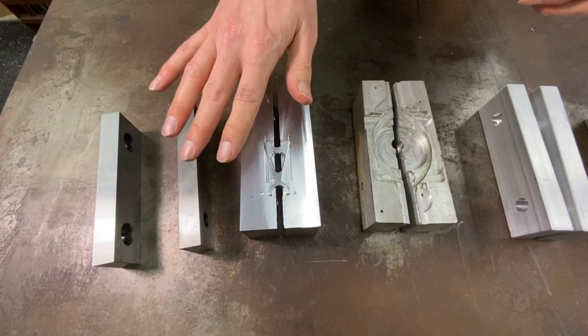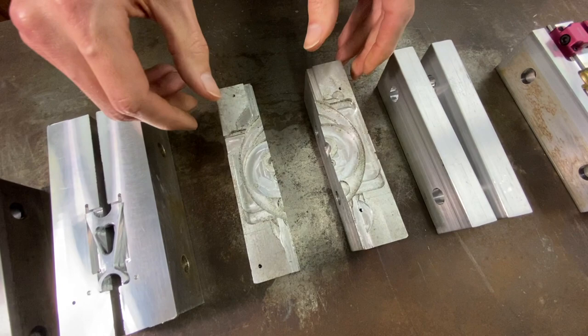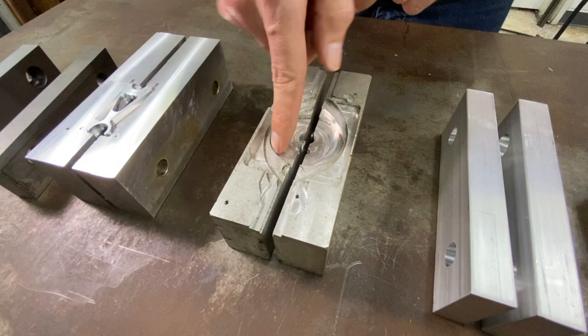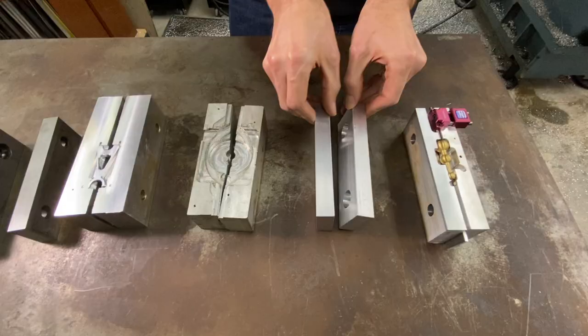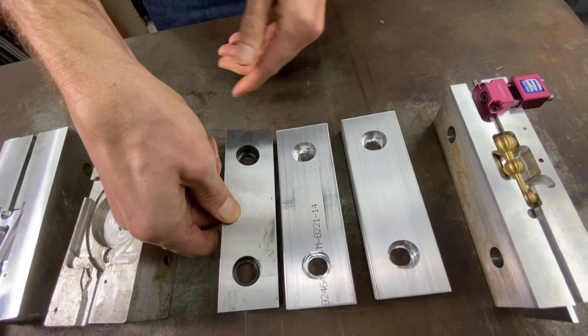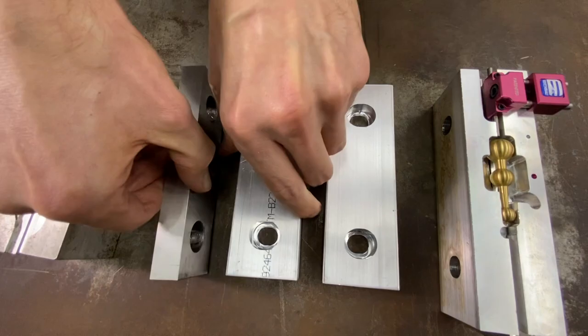Here's another very common set — these are old, you can tell, because they haven't been used in a while. These were used mainly for cutting circles, so you're able to clamp on round stock or round parts very precisely and very securely. You can see a smaller diameter in here, and if you open the jaw you can see this one was cut at a larger diameter. So these are what we're going to make today — a standard common set based off the six-inch vise jaw, but a little bit taller, which gives you the ability to flip them over and use both sides. The hole and counterbore are oblong so it will fit the Kurt vise either way.